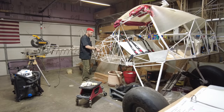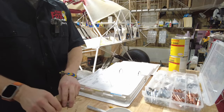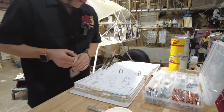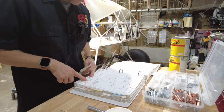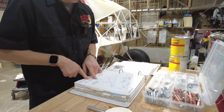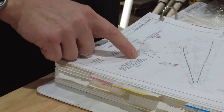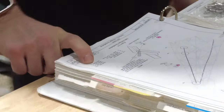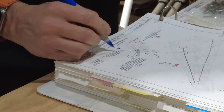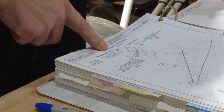We'll be scuffing it up with some Scotch-Brite in a minute. For rivets I need 1-5-0-0-2, quantities 1 through 8, and we're going to need one-eighth by one-eighth FHAL aluminum rivets — that's detail C in the book — which are required when I do the door frame installation. Right now I'm going to leave the front of the stringer detached and put an asterisk with a note, because sometimes we don't see the forest for the trees.